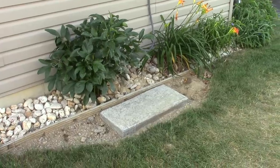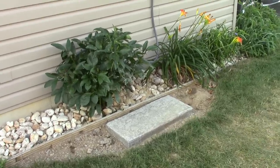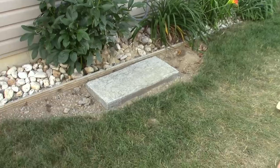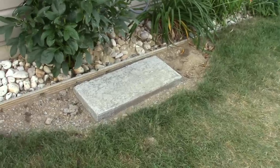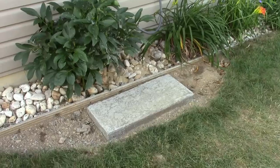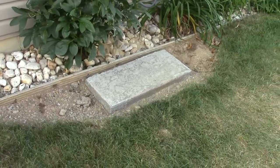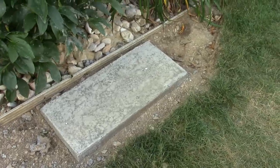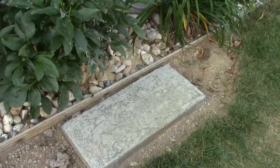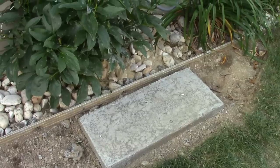Here's a look at my slab. I poured this because I didn't want to mount it on the house. This only cost like $8 and it was easy to do. I'll put a link in the description to a video where I show you how to pour a little slab like this. That should reduce noise and vibration. And now we're going to set the outdoor compressor on that slab.